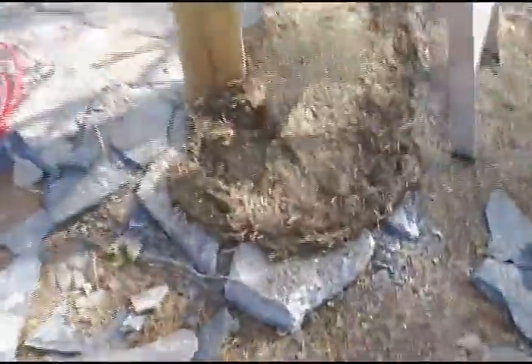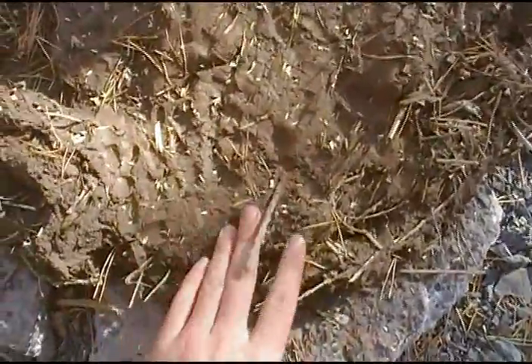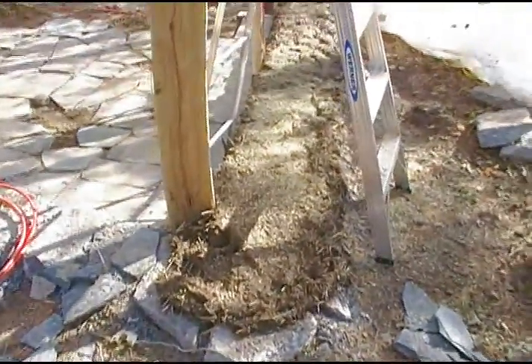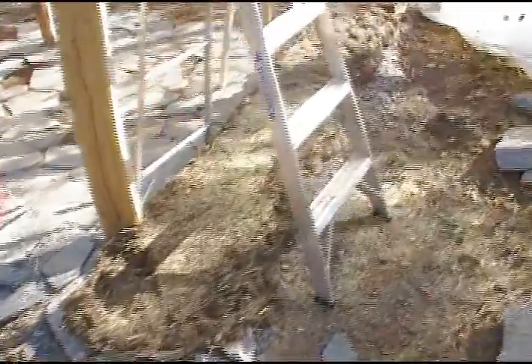It'll have more insulated value down low, where you can see the cob coming along. It's got some sawdust on it because I just ran my chainsaw to top off one of the posts, but it's coming really well. Tons of straw in there. I'm using just my subsoil, which is called Angola silt loam — you can look it up online. It's definitely silt, but it has enough clay that it seems to be cobbing together beautifully.